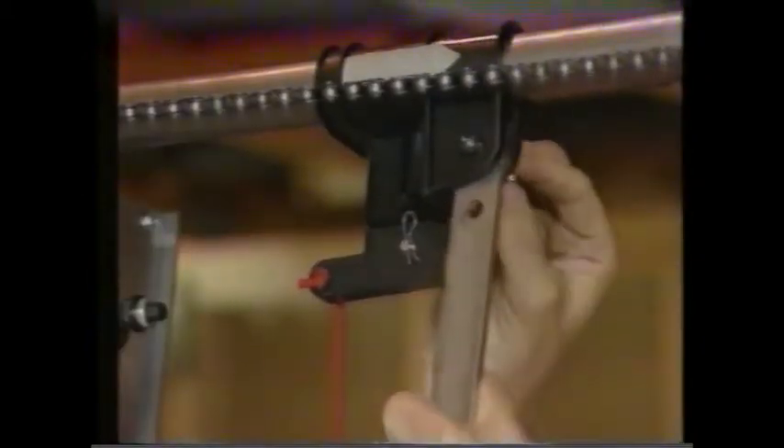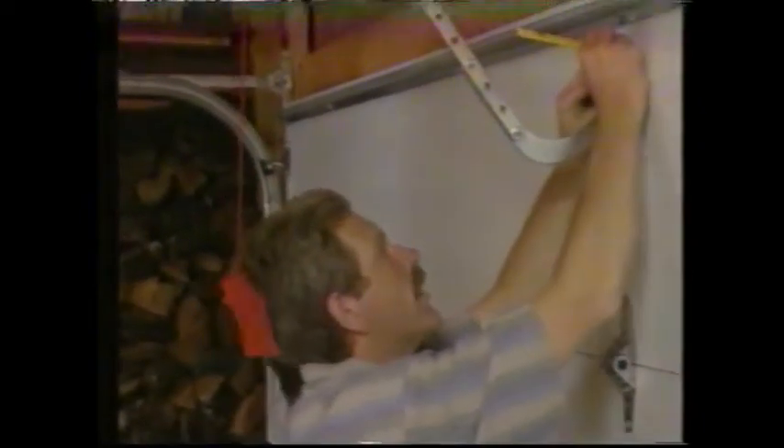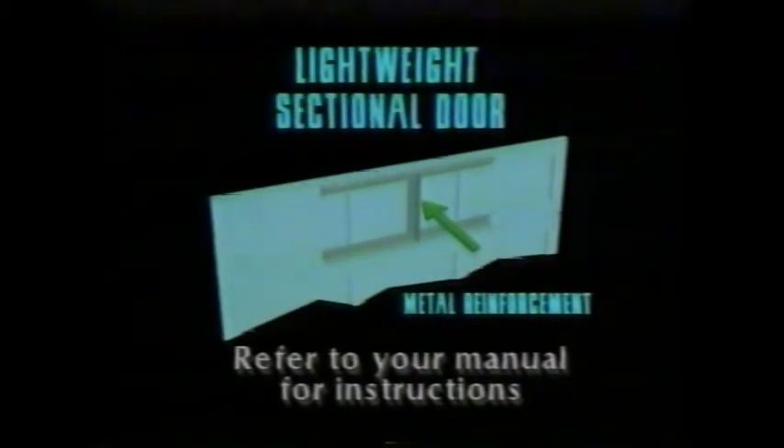Remove the 2x4 and very carefully close the door by hand, making sure that it clears the tube by at least an inch. To attach the opener to the door, first assemble the door bracket, the L-link, and the bar link as shown in the instructions according to the type of door you have. Secure the bar link to the traveler with a long clevis pin. Disconnect the traveler by pulling the emergency release cord and slide it down to the door. Center the bracket on the door, about even with the top rollers, 3 to 6 inches from the top of the door, and mark it. For trackless doors, this bracket should be mounted on the top edge of the door. Pre-drill the holes and attach the bracket to the door. Stanley garage doors won't require additional reinforcement, but lightweight fiberglass or metal doors may — consult your instructions for more information.